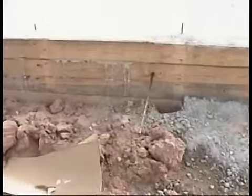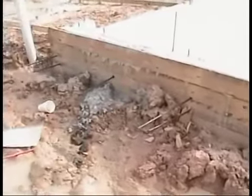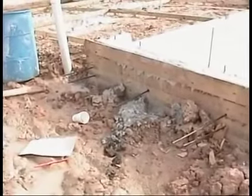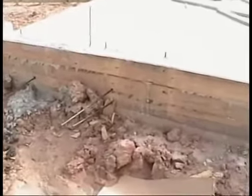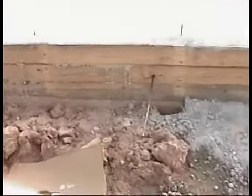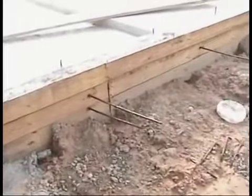Remember, once these tendons are pulled, they have to be grouted or capped with a non-shrink grout, and make sure again the nails are out. If the grout comes loose, air will get to the tendons and oxidation will result in rust and the loss of tensile strength. The grout is often knocked off also by homeowners carelessly using yard equipment such as weed eaters.